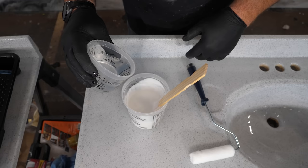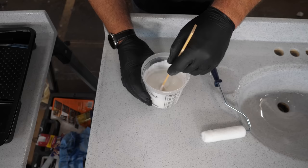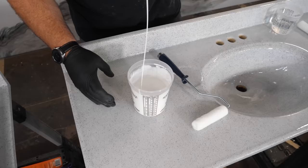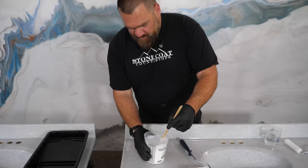You could add up to 5% by volume of water to thin the material out. Start with a little at a time — we're going for the consistency of thin latex paint. Now look at it — it's perfect. Now I'll pick it up and go in. It does instantly self-level. We're ready to go.